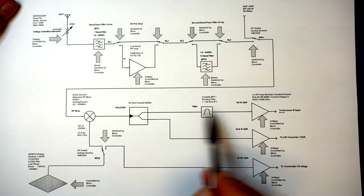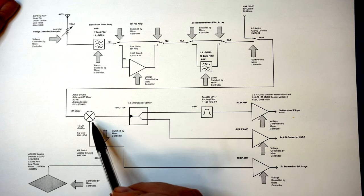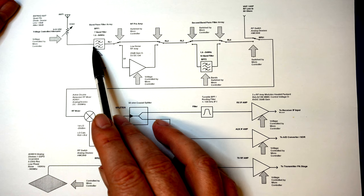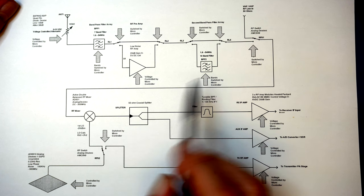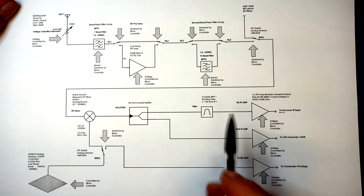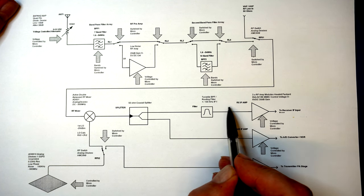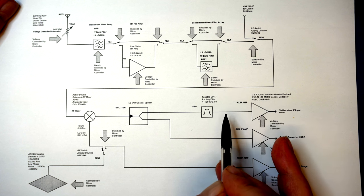The roofing filter is very good for impedance matching. As we get further into the receiver stages, coupling becomes increasingly important — it needs to be tight. Up at the front end it can be loose, but further in you need tight coupling. Just like with antennas and SWR, a mismatch causes reflections, and that causes noise — it reduces the signal-to-noise ratio.